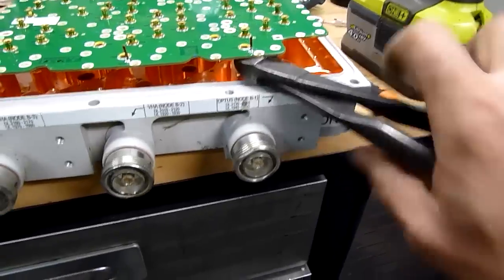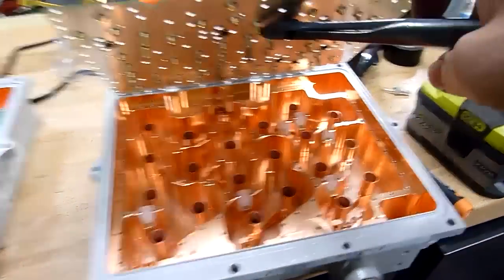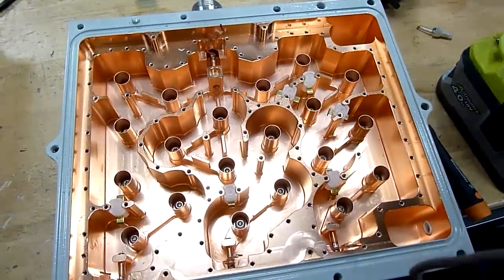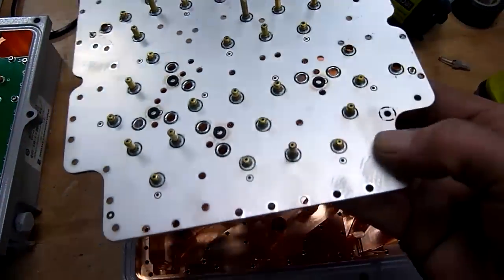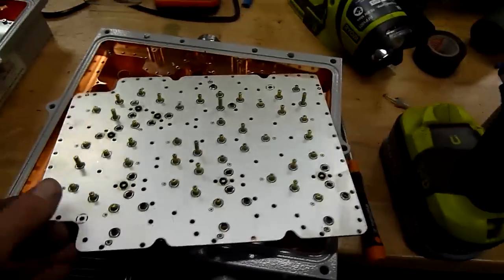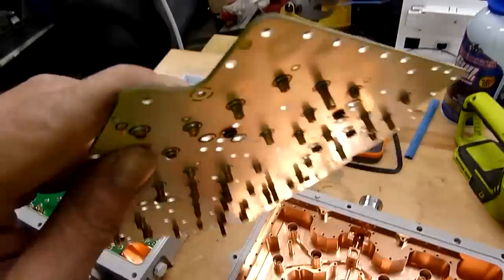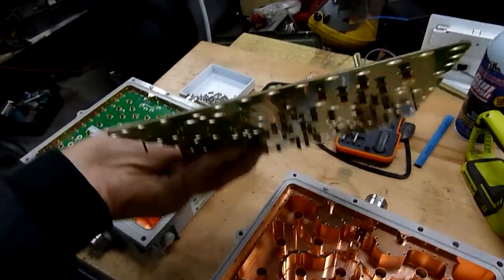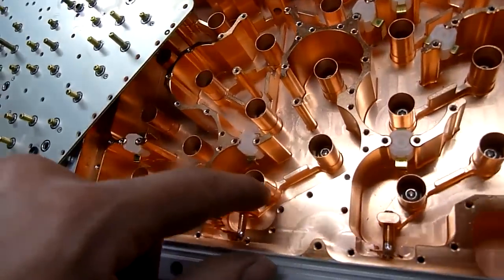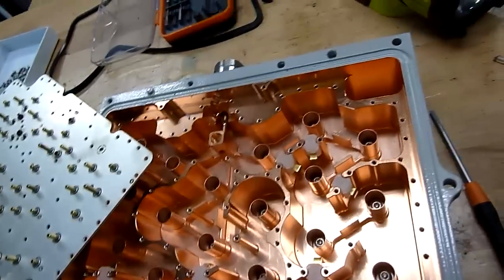Wow, okay I might open the other one up too. That's something just worth having hang on the wall. That side not so much - I'm guessing it's either silver or tin coated on this side, probably silver coated something really expensive knowing what RF gear is worth. You can see the push-through pins and they appear to be tuning because you've got these little copper cylinders with screws in the center of them - those screws are also at different levels too.